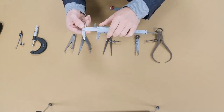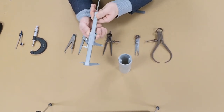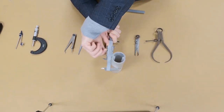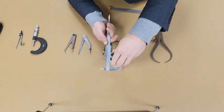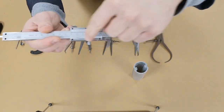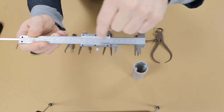This instrument may be used to measure outer dimensions of an object, such as this hollow tube. You simply widen the jaws so they're definitely wide enough to take the cylinder, then push the jaw up with your thumb — whichever is comfortable — followed by tightening the grub screw. You can then remove the vernier and allow the jaws to slide away. This is called the sliding scale — the vernier scale — and the fixed body is the fixed scale.